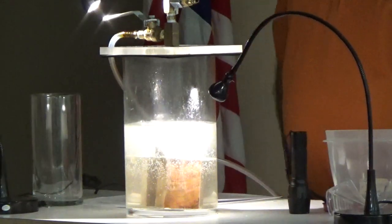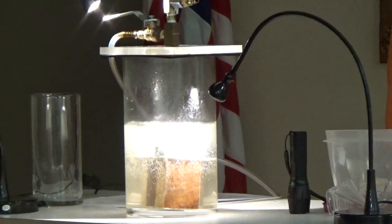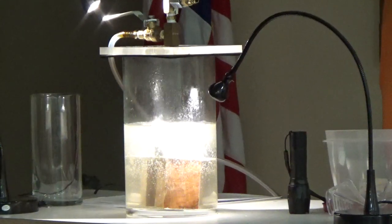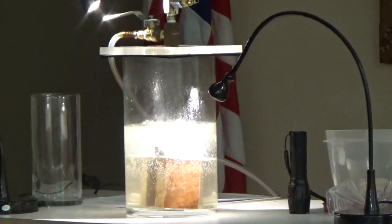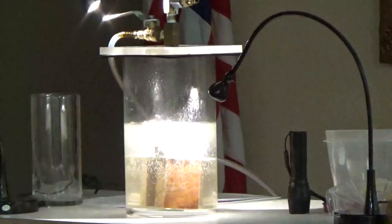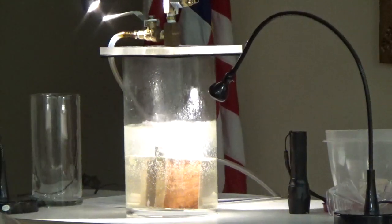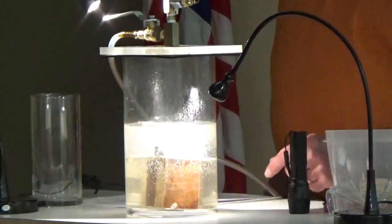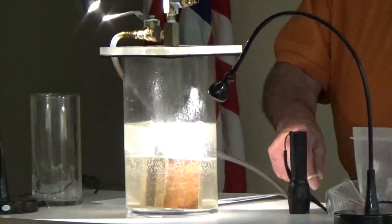And don't worry about hurting the pump. I was saying earlier, some people feel that pump and they go, it's hot, I gotta turn that off. Just let it run, they're built to take that. Big HVAC units will take 24, 48 hours sometimes to get enough vacuum going down on them systems. They can take it. Here, Adam, come up and feel that. It's only been what, 4 or 5 minutes? It's already getting warm. And it'll get to where you touch it, and you go, oh, that's not nice. It's not gonna burn you, but it's not nice. You let them go for whatever amount it takes. We obviously don't know the amount of time it's gonna take, but we're gonna let them run for a little while.